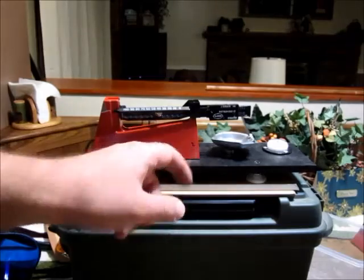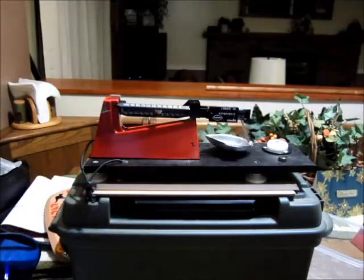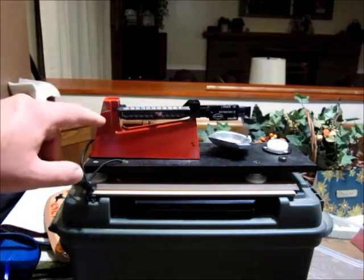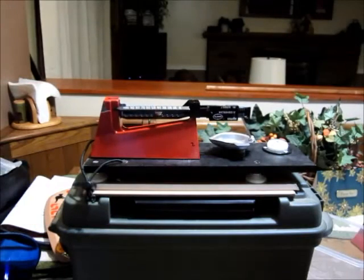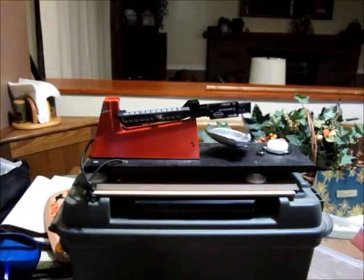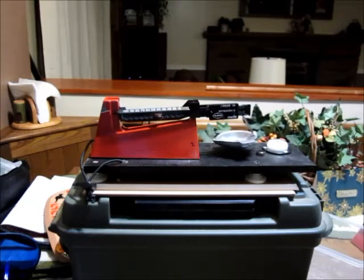Normally that would just keep going. Knocking the pan around transmits the bounce to the beam, making it more difficult to read. Just placing the magnet under there really takes the bounce out of it. I like to keep this one mobile because the check weights I use are stainless steel — while they're mildly magnetic, it's enough to throw off the actual calibration of the scale.